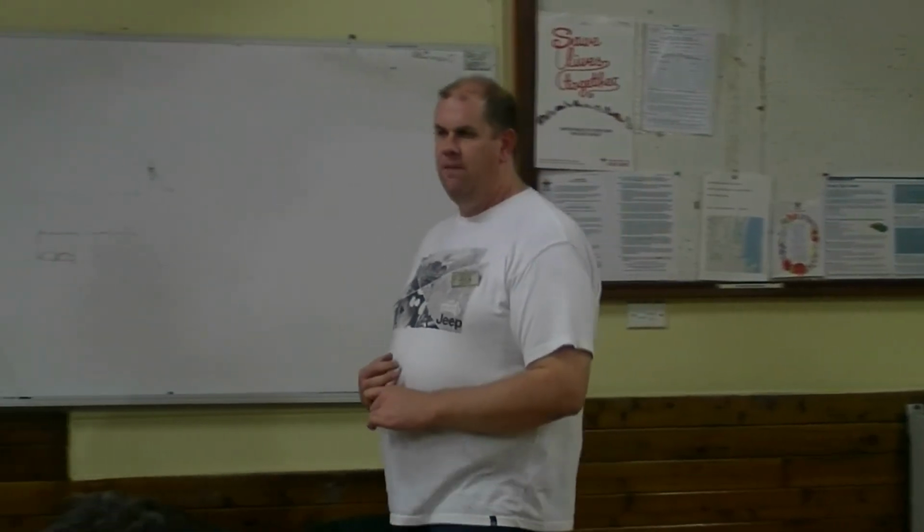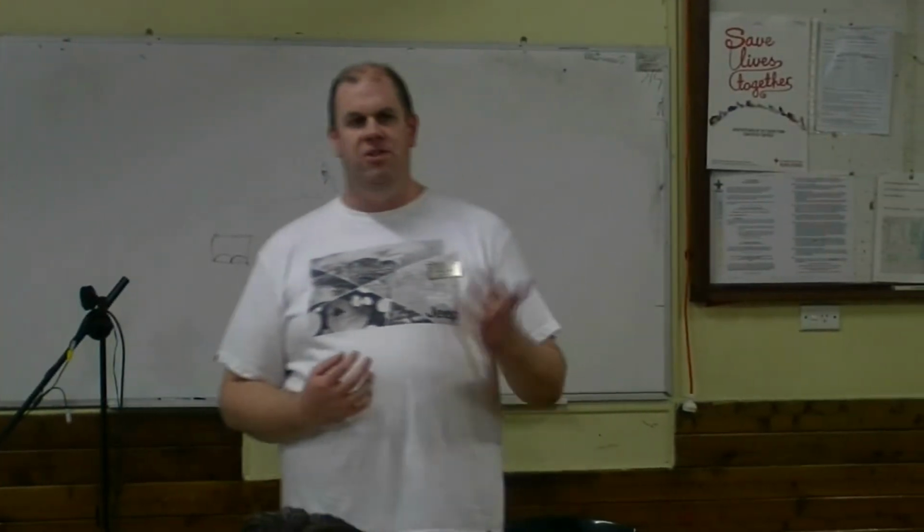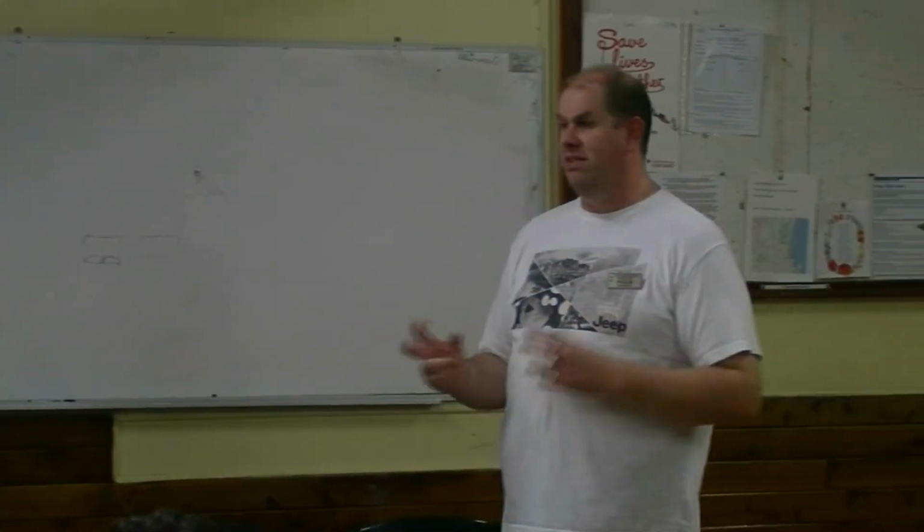A lot of people feel that D-Star is actually worse at that than DMR. They think DMR and P25 have some of the best voice. D-Star and Fusion not so much, which is counterintuitive to me. Fusion runs higher bandwidth. D-Star, I mean, this will come back to forward error correction, I suppose. Comes down to your algorithm. Yes, your codecs, your algorithms, forward error correction, the whole lot. And that's what makes the difference between all of the technologies.